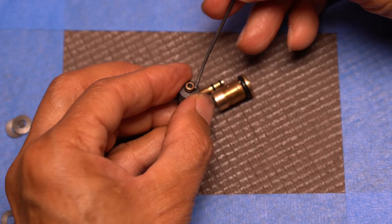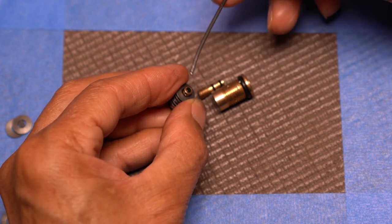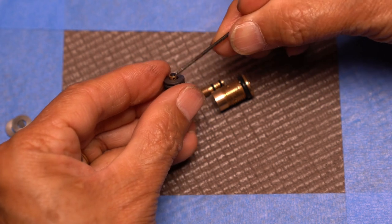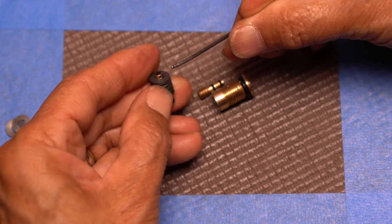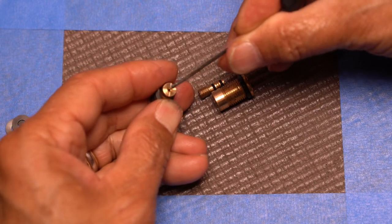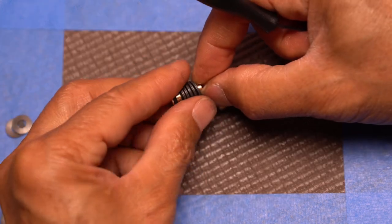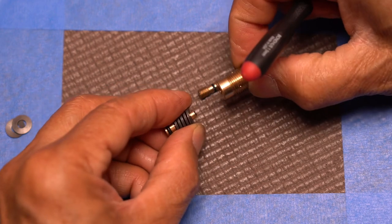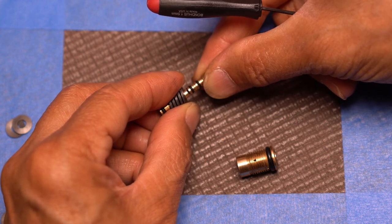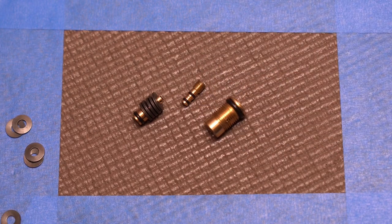Alright. And there's a Delrin seal here to seal the supply. If you get the right rig pressure, it will make up and seal. When it opens, there's a vent hole on this side, and then this side all goes through the piston and comes out here and fills up your plenum. Remember, when you reach a certain pressure in the plenum, this would shut, made up with this adjustment screw, and cut off the supply. All right, next one, gonna reassemble it onto the gun.